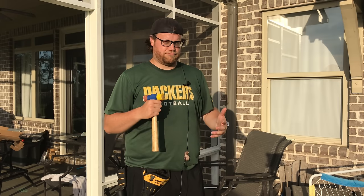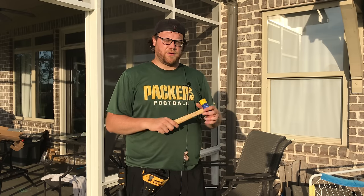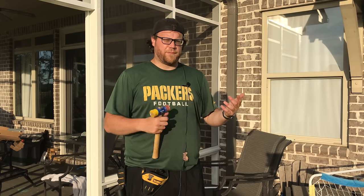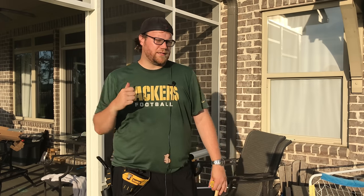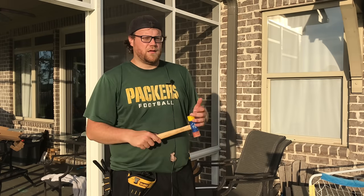Hopefully this video helped you out and maybe saved some frustration, and gave you a better understanding of how the process works. And overall, I'm very happy with the system. I think it's worth the extra money to do it this way. I don't think I would have been able to get these screens as tight as I did by hand with the staple method and putting lattice strips on top.